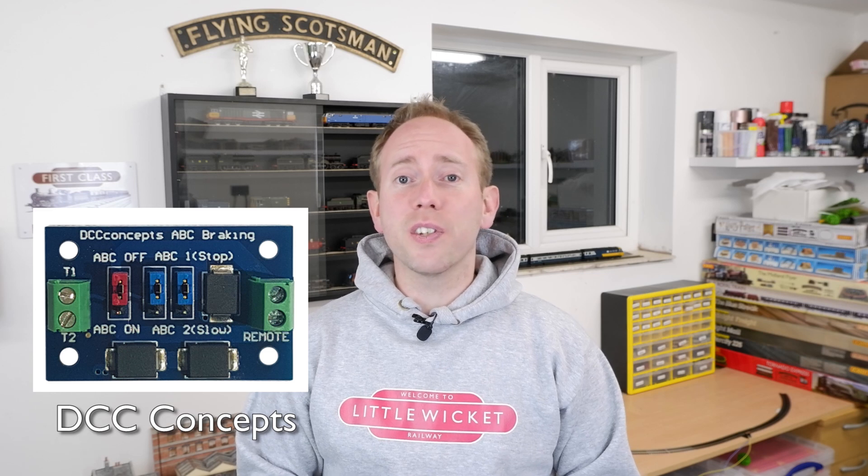So there we go — that's a basic demonstration of how ABC braking can be integrated with an occupancy sensor, a relay and some LEDs to create easy automation for only a few pounds. I've made my circuit quite large for demo purposes but you could easily squeeze all of that onto a small printed circuit board. There's quite a bit more to ABC braking than I've had time to cover — many decoders let you adjust settings like stopping speeds, restart timings and the direction of travel it applies to. Of course you don't have to build your own ABC modules; they're available ready-made. The Lenz versions are the most expensive, with the basic module at around £13 and their top-end module with block detection and signalling at around £60. DCC Concepts do a nice board with jumper settings for just over £10, and Lais DCC do a very basic module for under £5. There are probably other options out there so do have a Google.